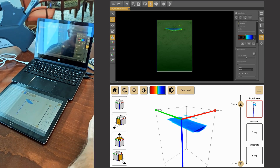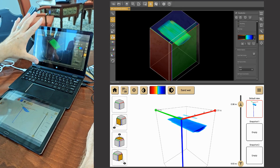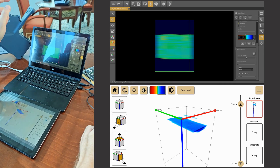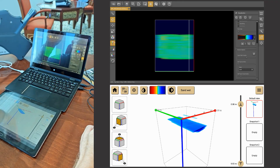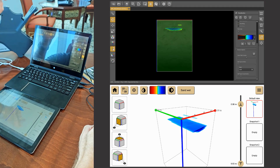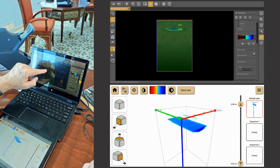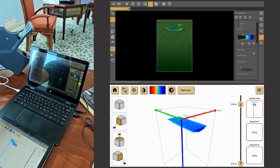The main point is to see how clearly the water shows up and how clearly the pipe shows up. You can see it on the tablet, but when you're in Visualizer 3D, you can switch to your 3D mode, and when you do that, you can see the water really dominates the image. In the top-down view, it's the same thing — you can see that water is about two meters deep and about two meters wide, so that's a pretty big pool. When we go to the side view, you really see the round cross-section from the pipe that's buried, and you also see the cross-section of the water that's accumulated below the sandbox.